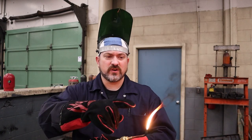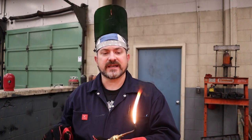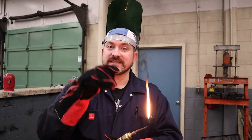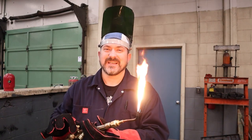The first thing you're going to notice is a lot of black soot and smoke — this is really particular to acetylene. We can use this to help guide us to where we want to set the level of acetylene. Slowly open it up more — lefty-loosey — until that smoke goes away.